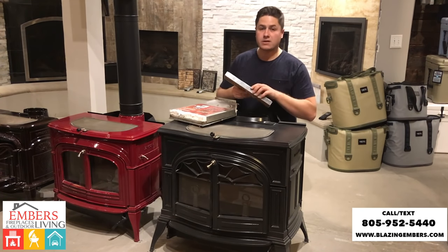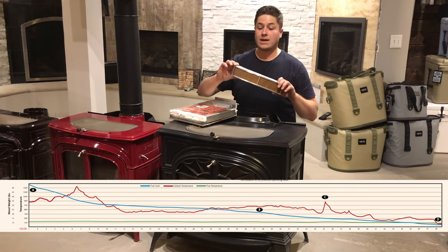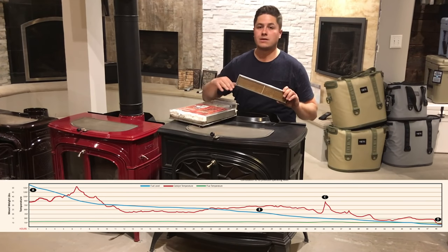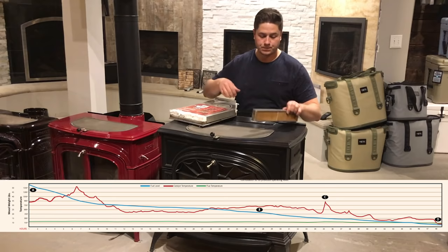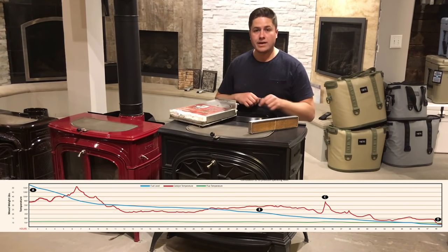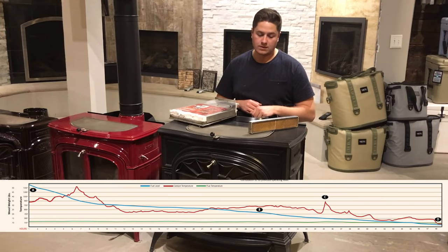Although it is just as efficient, because it's burning through as much of the soot and wood as possible, it's doing it much faster and getting hotter in a faster period of time, which is going to result in seven to nine hour burn times. A catalytic combustor is going to be more slow and steady — and some would say slow and steady wins the race. You can have even temperatures of six, seven hundred, sometimes eight hundred degrees for 30 hours in a burn cycle, because of this chemical reaction. So over a longer period of time, a catalytic stove is going to heat more efficiently, because it can re-burn for longer periods without you having to reload wood as often.